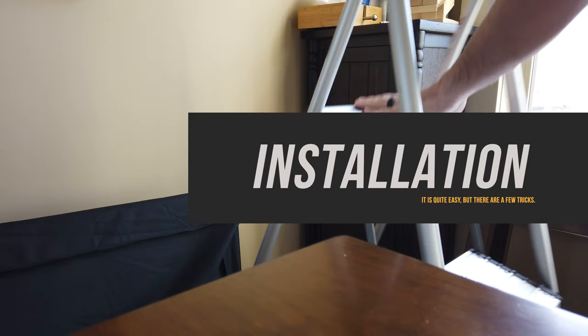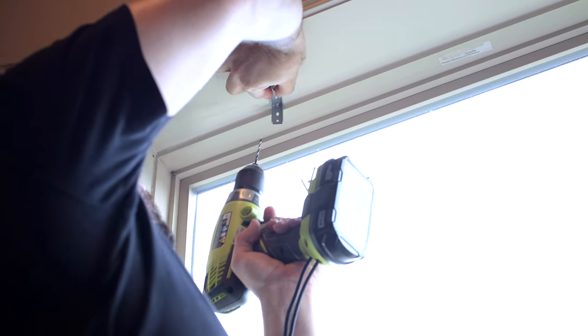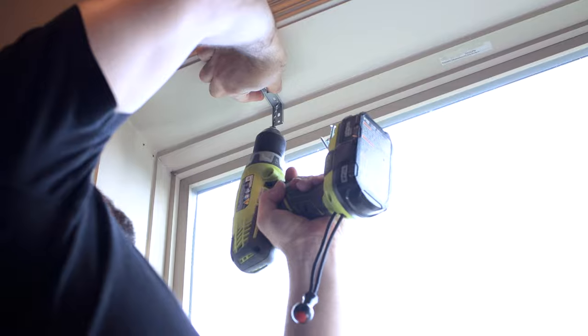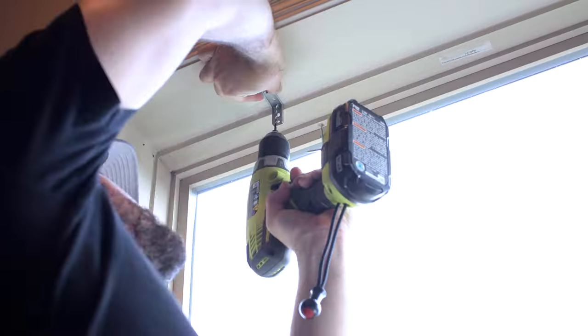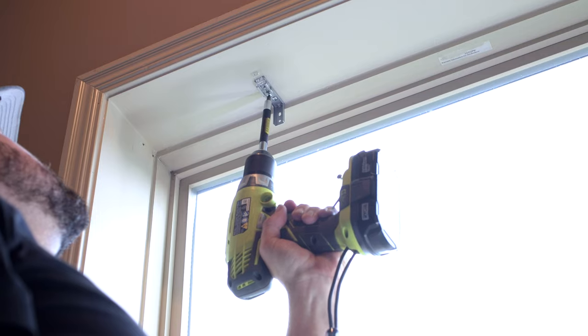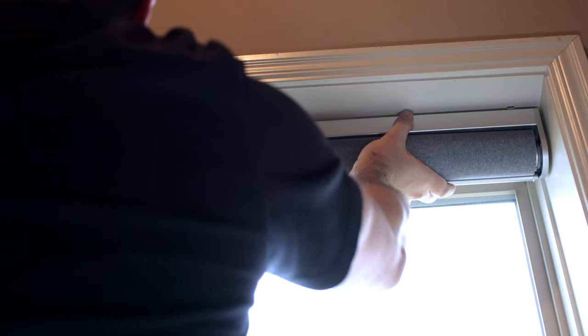Installation is quite easy. Grab a ladder or step stool, a drill and the appropriate bits. Double-check that the blind is the correct fit before drilling. Note that unlike most roller shades, the left bracket is not installed all the way to the left — this is because of the electronics; they want to keep as much metal away from the Zigbee radio as possible. Measure how far away from the wall you need to start before drilling your holes, and make sure the right bracket is a little bit away from the edge of the window. Line up the bracket and drill two holes, repeat for the other side, then screw in the two brackets — make sure they're straight or you will not be able to snap in the shade. Finally, line the back of the shade up to the back of the bracket and rotate the shade upward until it's flat. Push in on the plastic tabs on each bracket until you hear it click — that way you know it's in place.